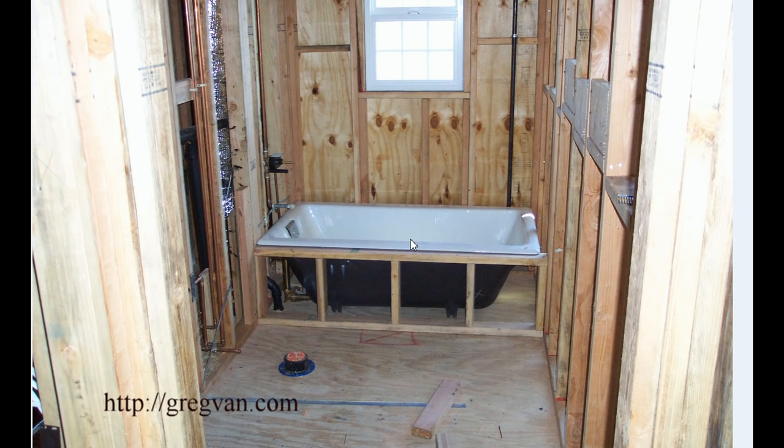This provides you with two benefits. One, you can install heavy tubs easier. Two, you can get the exact height you want for your framing. I can't tell you how many times I've had a tub in a box, not yet installed, and tried to get the right measurement — it's a nightmare. The tub's upside down in a box and you're trying to figure out the height, and it never seems to work out.